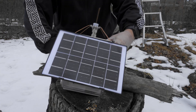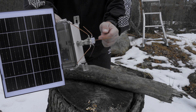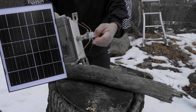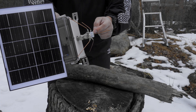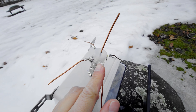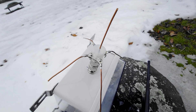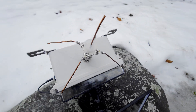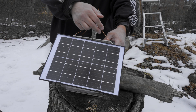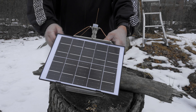I like making these quarter-wave antennas. I put a little cap on here to keep it straight. Basically you solder to the center pin of an N connector, and you have four areas where you can attach either ring terminals with screws, or if you get the top-tier brand of N connectors, they'll be silver-plated so you can solder directly to them. These are nickel-plated, so they're not as good for soldering — that's why I went with ring terminals and 12-gauge solid-core copper wire from Home Depot.